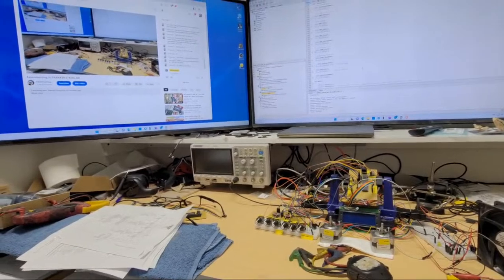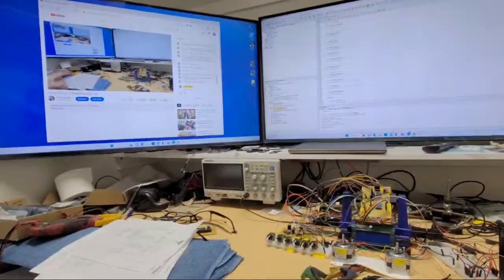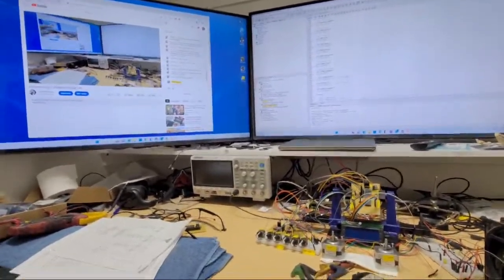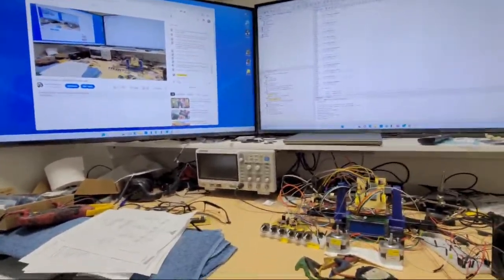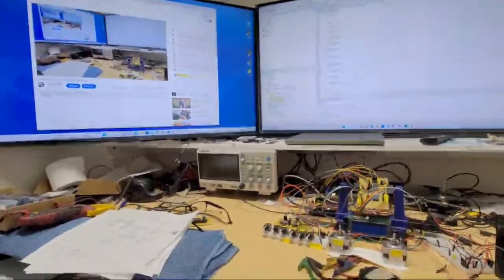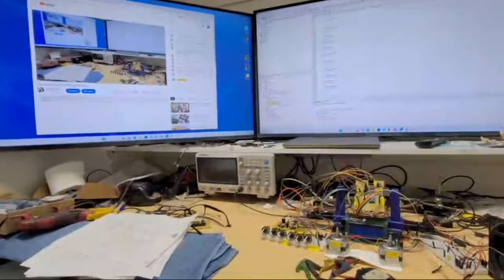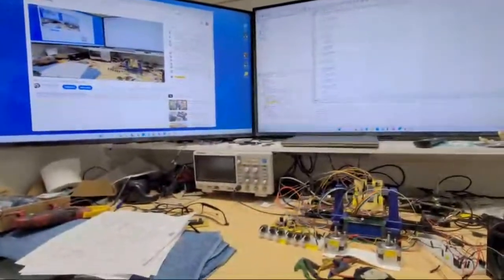And when I was saying 1075, 850, that was not a 3-phase, but a single-phase motor. So I think they're 6 and 4 pole or something like that. But I think in 3-phase motors, they're 4 and 2 pole, right? 4 for the 1700 and 2 pole for the 3600-ish range. They haul ass. And then 50 hertz for the rest of the world.